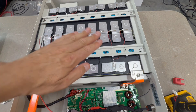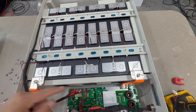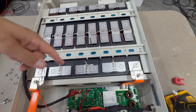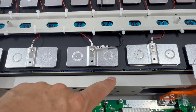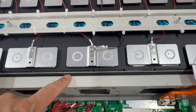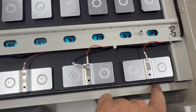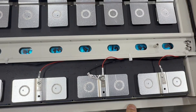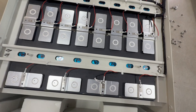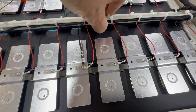You can see the cells are a short profile to fit in this wall mount battery — the other batteries are a bit taller. Because these cells are going to be on their side, they have to be bound up well. There's one bracket on the bottom supporting the batteries, with a piece of foam and an insulation board between the cells and that bracket. The top end has the same setup, and the brackets themselves have another piece of foam on the bottom of them.